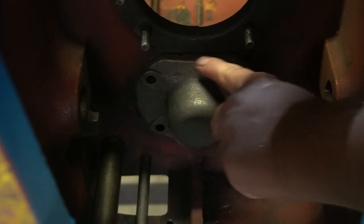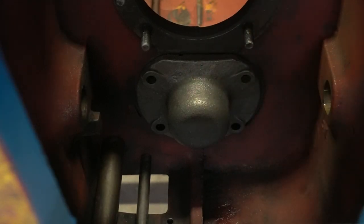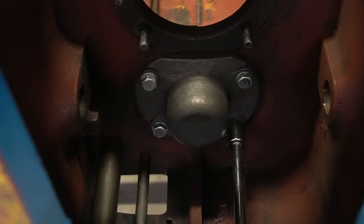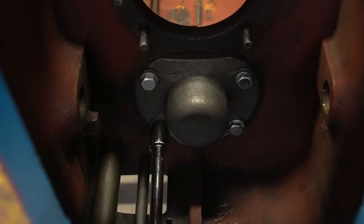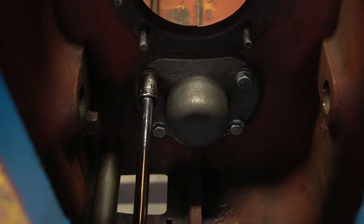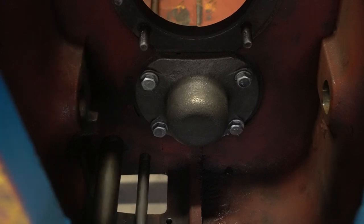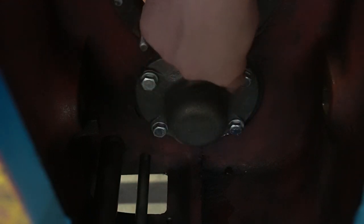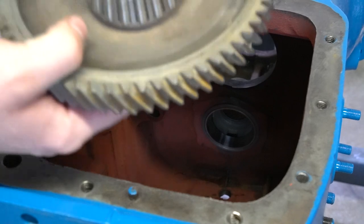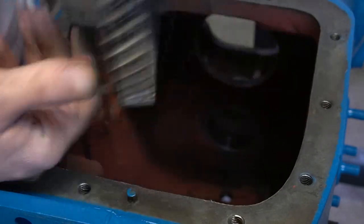This flat edge is going to be up towards the top and we're going to put our bolts in along with new lock washers, and we're going to go ahead and torque them down to 20 to 25 foot-pounds. There's our retainer installed - you're going to want to run all these up and then torque them in a crisscross pattern. Now with the bearing retainer in, the next piece to go in is our PTO gear with a new bearing and a new race.